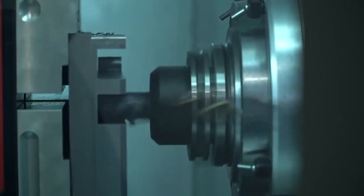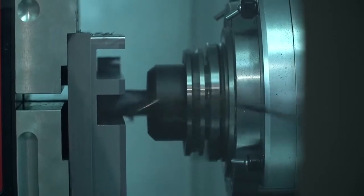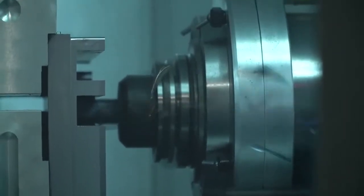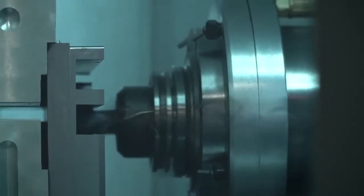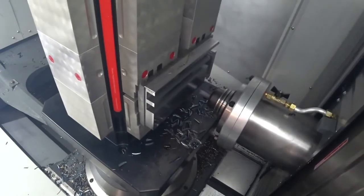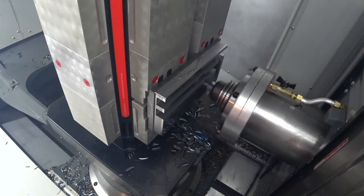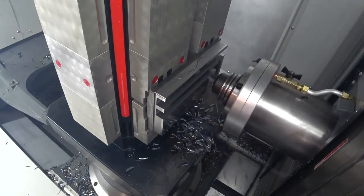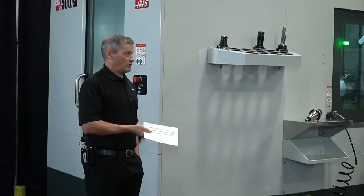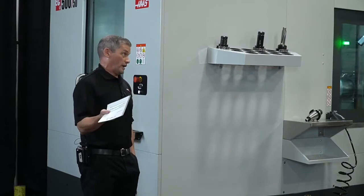And that can potentially be as difficult to cut as a harder one, right? In terms of, you've got a high gumminess factor potentially. Yeah, the gumminess, particularly for drilling and any operation that's sensitive to galling or binding up in the flutes. Right. Having watched and videoed a lot of the Haas tooling test cuts, oftentimes you have more difficulty with these gummy materials, even though they're softer. Some of the harder steels are much cleaner cutting.